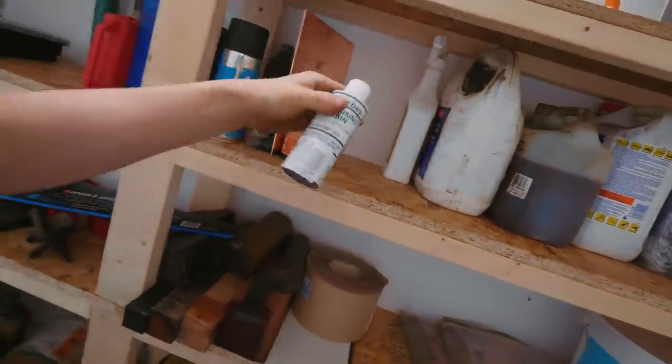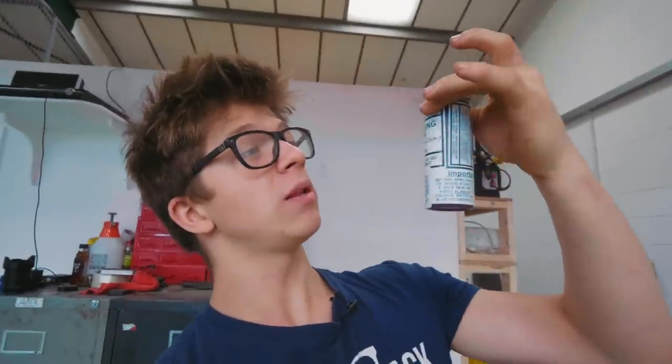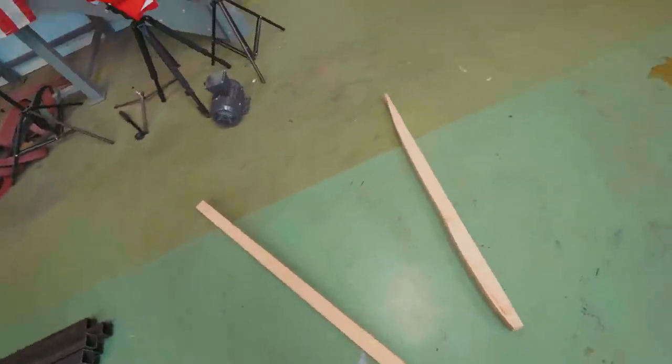Well, my game plan is as follows. I planned ahead just about well enough to know that the handle looked purple. I investigated into getting some purple heart wood in time but couldn't get any large enough or long enough. So what we have is the ash, and I have number 12 red mahogany stain, which should work to make the wood brownish red. It's been bandsaw cut and now it's time to move on to the shaping.